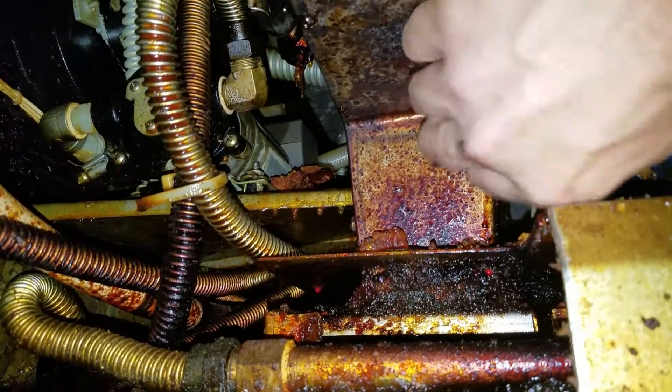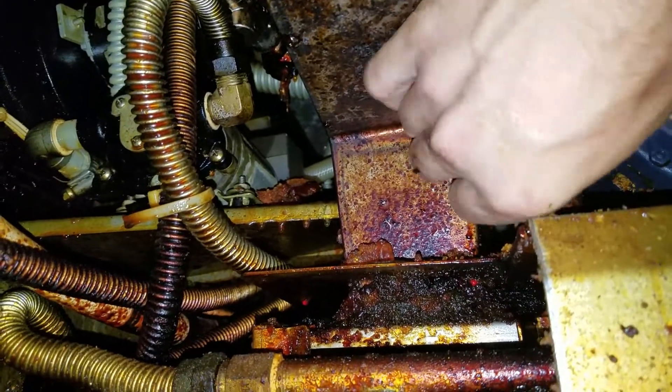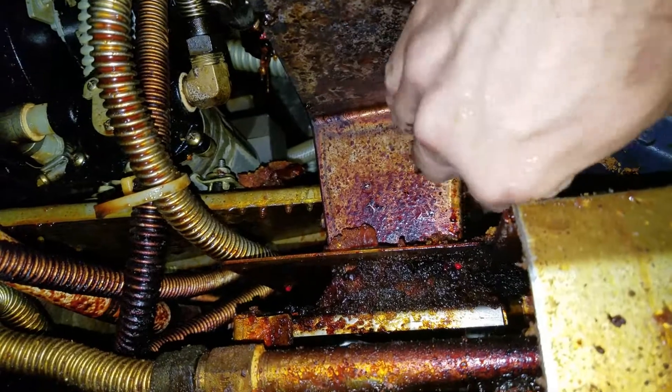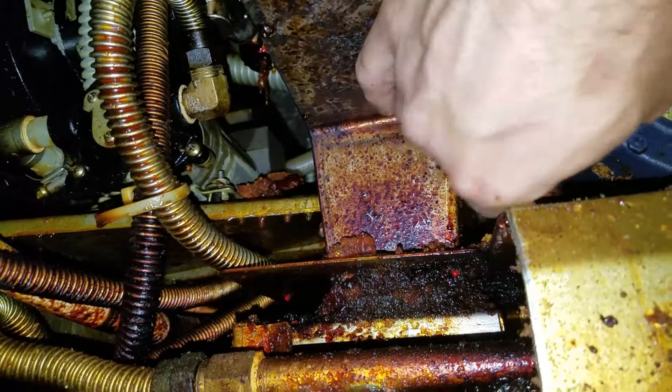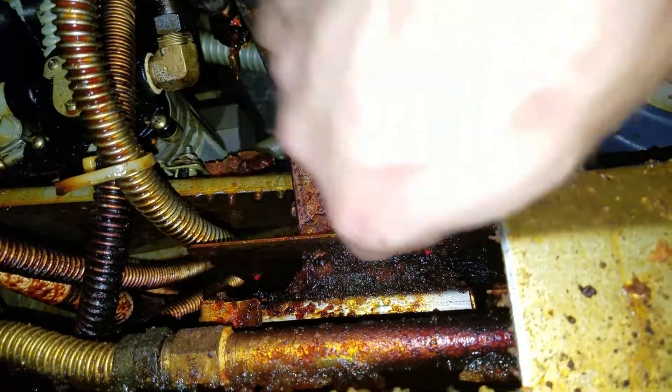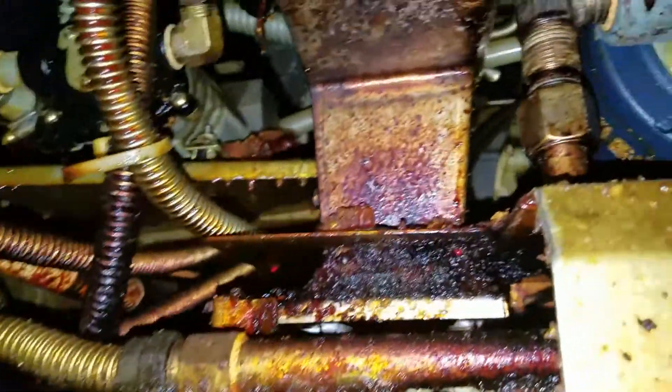This is on the underside by the way. Now you may be wondering why I'm not using gloves - the reason is gloves just kind of get in the way, so I'll just wash my hands a hundred times. There we go, now it's undone. All I've got to do is undo those nuts and bolts. To get to this back bolt you actually have to reach around to the back with the wrench and then with another wrench or ratchet get to the bolt underneath. You're going to see there's a bar here and another one right here - do not remove those bars at all, you're going to make life so much more difficult if you do.